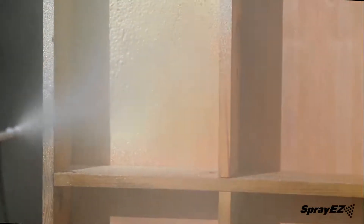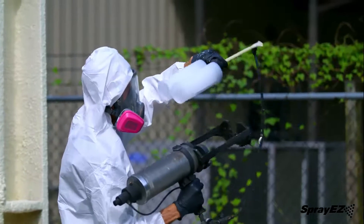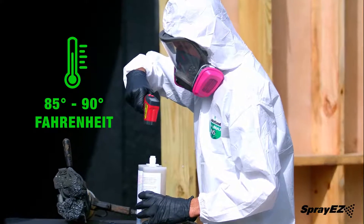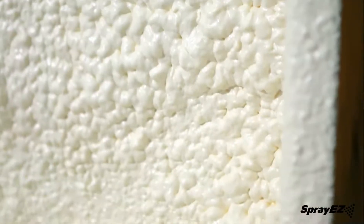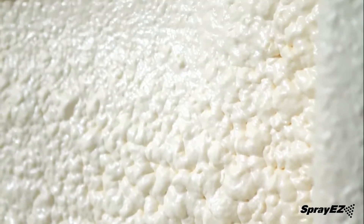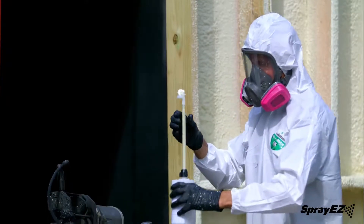Face the area you'll be spraying and from top to bottom spray the material out completely. Once you start spraying a cartridge, you cannot stop. Once the cartridge is empty, eject it and repeat these steps. It is mandatory for the foam cartridges to be between 85 and 90 degrees Fahrenheit before spraying. If they are colder, the material will thicken, causing the pistons to move slower and your static mixer will clog after spraying only half a cartridge. If the materials harden in the static mixer, you will not be able to use that cartridge or that static mixer. One of the unique features of the Fast Kick Gun is there is no cleanup — simply disconnect the air atomizer and pull out the cartridge and throw it away for disposal.